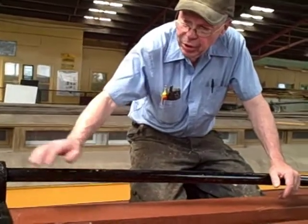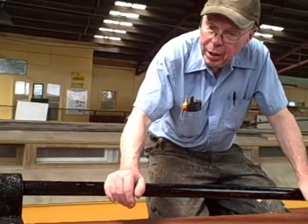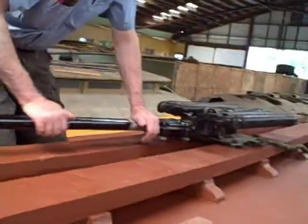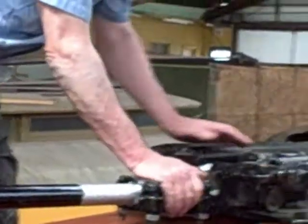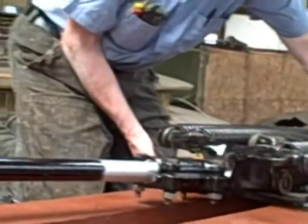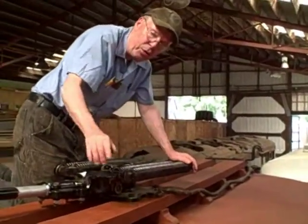When it ran with one trolley base they didn't have hooks, but since we store our cars away without any connection to the overhead wire, we decided it's best practice to have hooks on here so the pole is hooked down. The main power for the trolley comes from the overhead wire down through the trolley base. Notice this is aluminum — that ensures good conductivity between the pole, which carries the power, and the base, which conducts the power down to two wires, one on each side, going to the circuit breaker above the motorman's head. Each one controls the motor on that side.